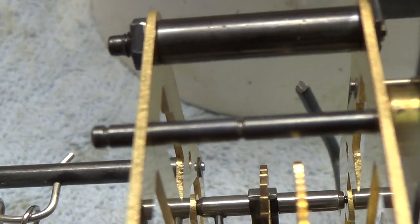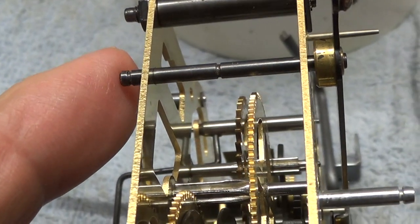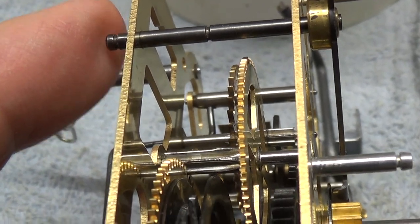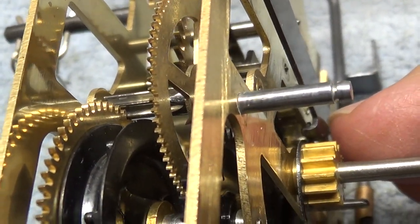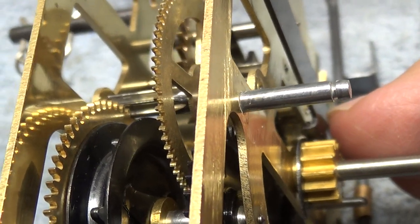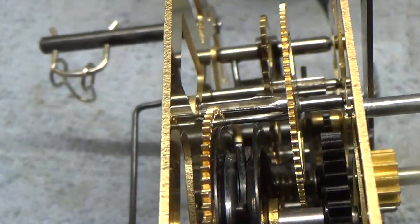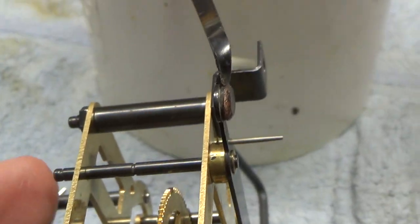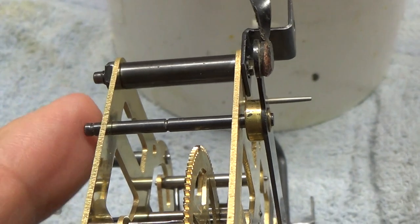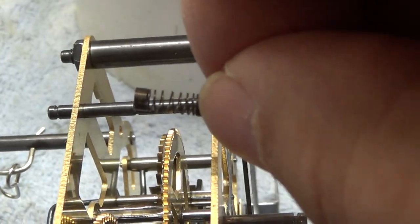that lever had what was called a night shutoff on this movement. And what would happen in a night shutoff is there would be a lever back here that would push on this, push this lever out, disconnecting it from the cams on this minute shaft, and that would keep it from cuckooing at night. And to turn the cuckoo back on, you release that lever, the thing that pushes this in, and then there has to be a way for this to spring back. And so this has a spring that has to go in here.